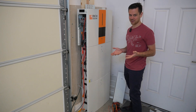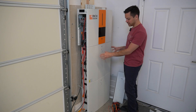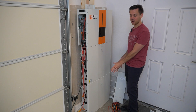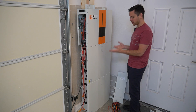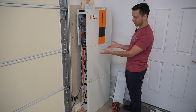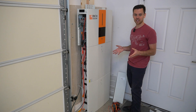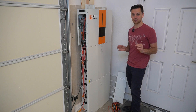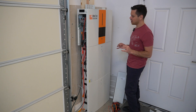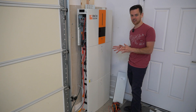For some of you that have a cabin and only need 10 kilowatt hours of storage — say you have a 6,000-watt ground array — this might be perfect. It can turn itself back on, run a Wi-Fi router or a Starlink, and run it year-round even if you're not there. The EcoFlow Delta and other solar generators do not have this autonomous functionality, so this is still very useful — but it's not for everyone.